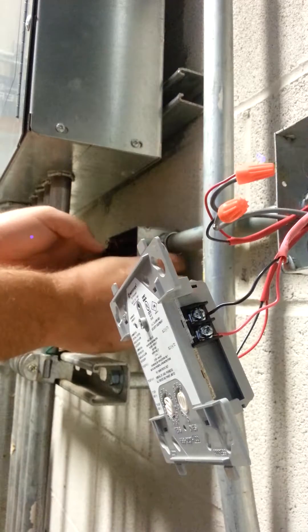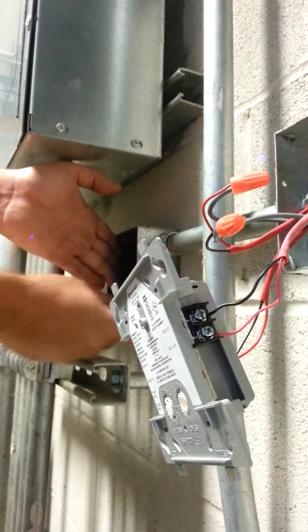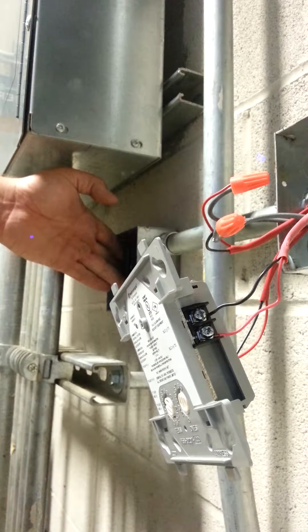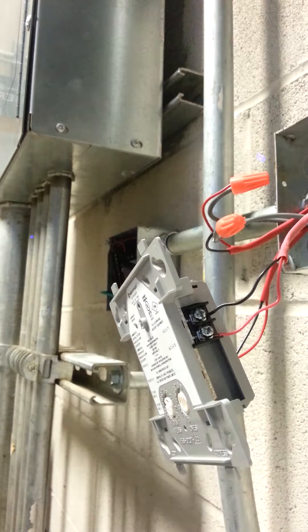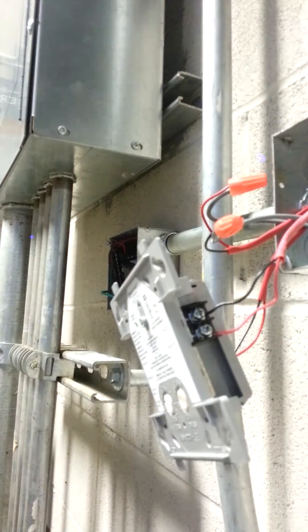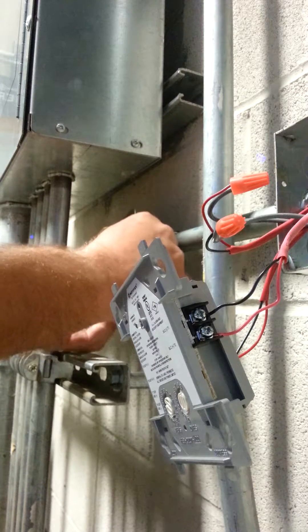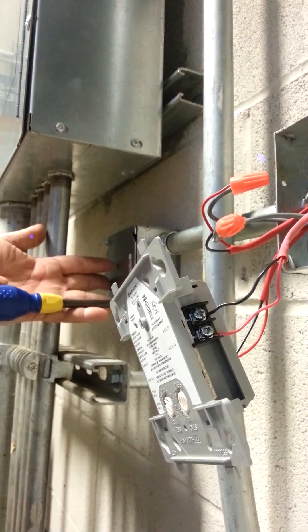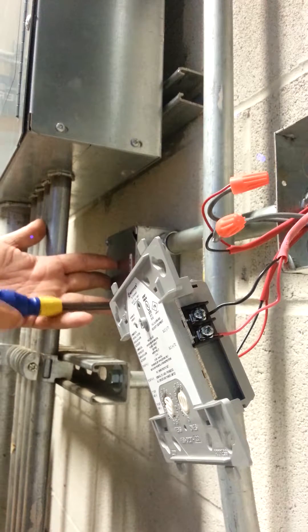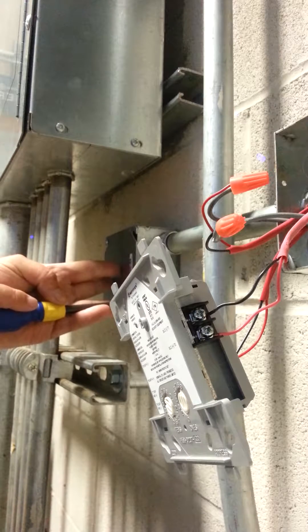I'm taking my time here when I do this. You don't want to rush and give yourself a ground fault after all the hard work that you just did. Twisting that little spade up in there. Here's the cover — putting the cover on. Now whenever I tighten that down, it's going to tighten down around my ground strap, because I put one of the little circle loops on it so that way it'll keep a good ground.